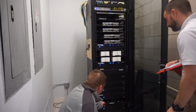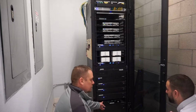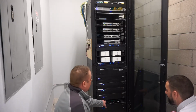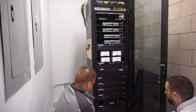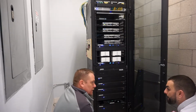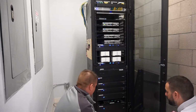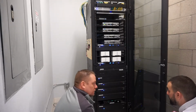This right here is your fitness video router. What that does is there's no internet off of this whatsoever. All of your internet comes from the MPOE room. So the way AT&T works is you have a router that gets these to the outside world for all of your video. So that guy's here, so there may be a time where the AT&T boxes are acting up or they say can't connect. You'll reset this guy right here. This is your UPS, main power source for the rack. You want to shut everything down, hit the power button there and hold it and you're good to go.